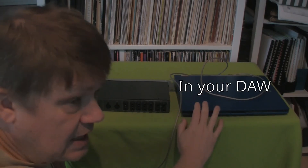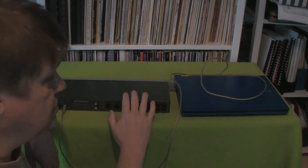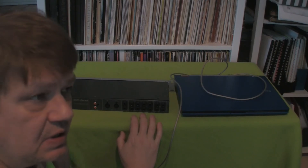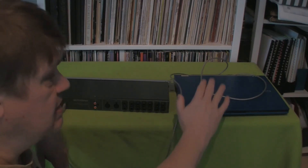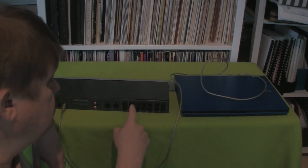It's once again a little bit later — actually several weeks later. There is one additional thing I have to mention. Because there actually is no control software, the control software you're able to use is actually in the computer. I didn't know that the Firewire driver in Linux is able to command this Presonus unit. The thing I learned was that when we started to record with the FirePod, I didn't check the input and output setup in the recording software. I should have done that, because that is actually the one that's going to pretty much determine what comes out of the signal channel outputs that you have here, and the other outputs as well.